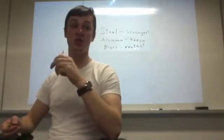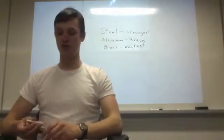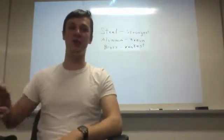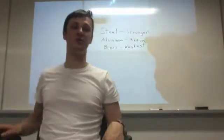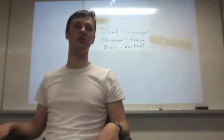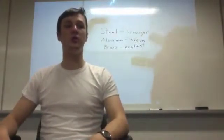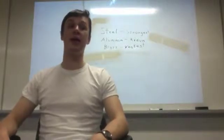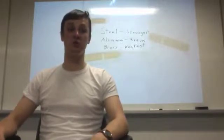25.76 joules, which gave an error of 1.11%, and 8.46, which gave a percent error of 8.18%. Izod value was 776.4 kilojoules per meter squared for steel. For aluminum, 325.6 kilojoules per meter squared, and for brass, 97.75 kilojoules per meter squared.